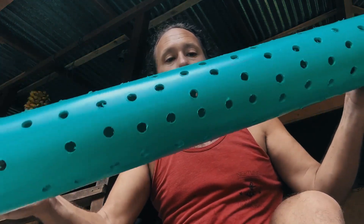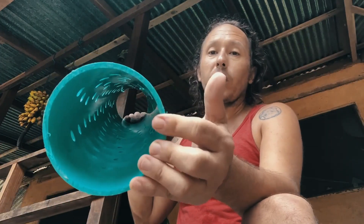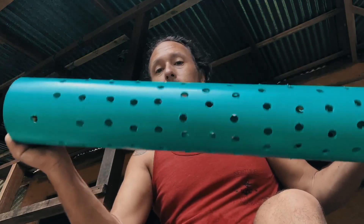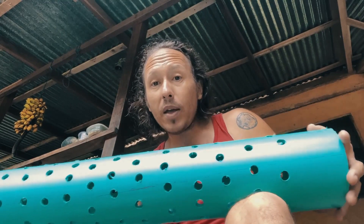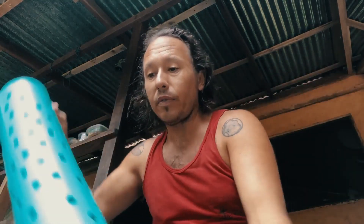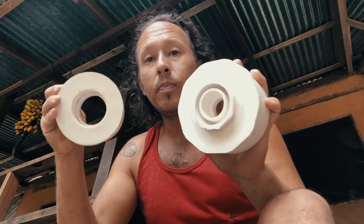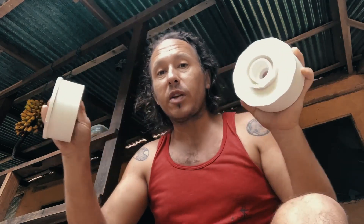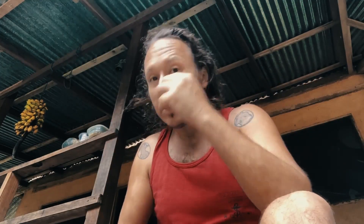We needed a new intake filter. To do that, I drilled a bunch of holes into a four-inch piece of PVC — thick-walled, high quality, because the last one broke. The holes are where the water comes in. On the other side we just need something to cap it and connect it to the hose. I've got a three-inch to one-inch reducer, and on the other side a three-inch to two-inch, giving me two little nubs I can tie wire to so I can tie a piece of screen around — that'll be the first level of filter.